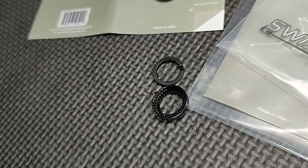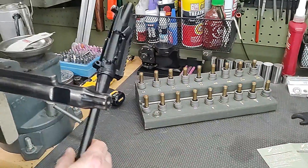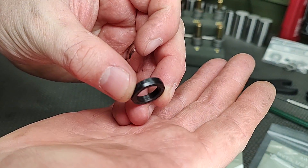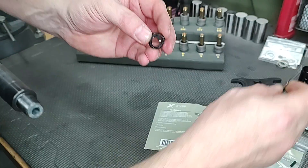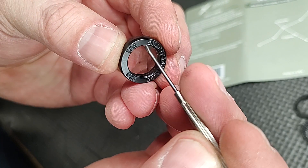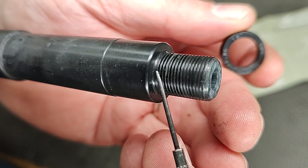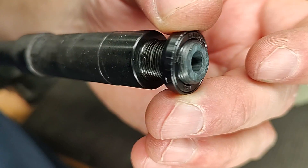Basically you find the right timing, and I'm going to do this at my vice. We'll just mount this old upper in here. I already have one shim set up — you can see it has a taper. I'm going to put that taper towards the shoulder of the barrel. Something nice they did: they added a chamfer or bevel on the inside of the shim. Because some barrels, right here on the shoulder, have a non-sharp cut. It should have a perfect L-shape so the shim can lay all the way flat.